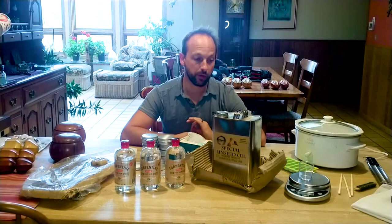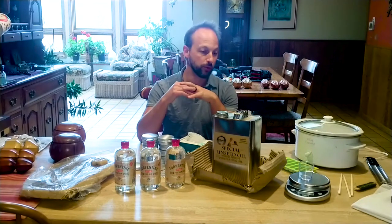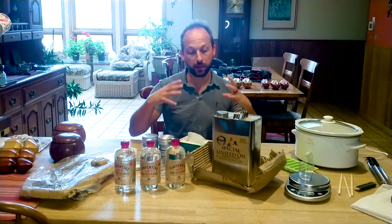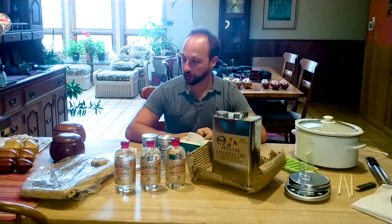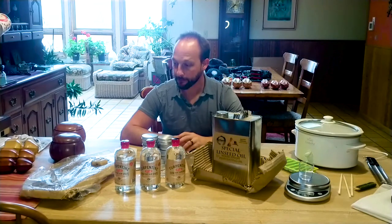They usually do that with a vacuum process. They vacuum up the oxygen, heat it to 550 degrees or something like that for a couple days, and that kickstarts the polymerization process so that the final product will dry in maybe 48 hours, or cure, I should say, because curing and drying, again, are very different things. Something might feel dry, but not have finished curing. So you really don't want to use a cutting board or anything that you've put linseed oil on until it's finished curing and all that polymerization is done.